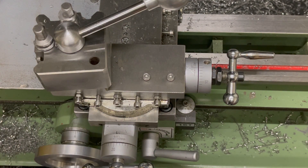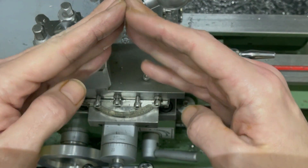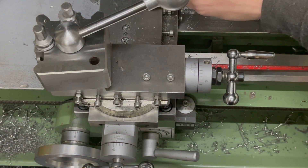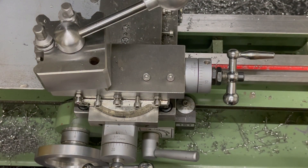We're making a metal block so that the tool post can sit right on top of it. I've got two-inch billets, so that's what we're going to be using. I'm going to clean them up because they're all rusty, put chamfers on each side, and then weld them together. There are screws underneath that bolt to the cross slide, and then this block bolts right to that. As long as we weld it properly it should be solid.